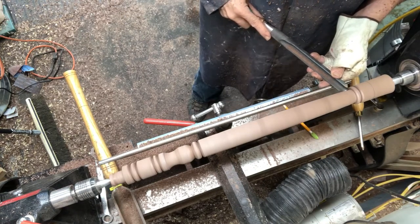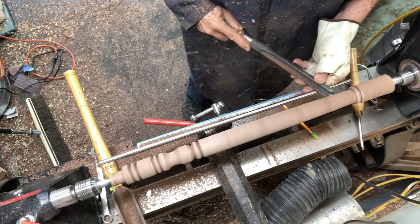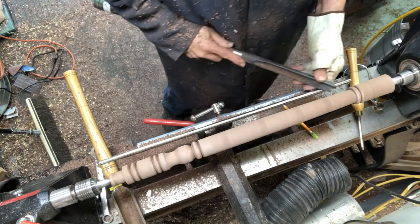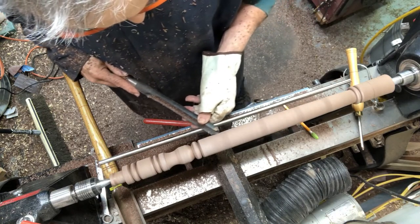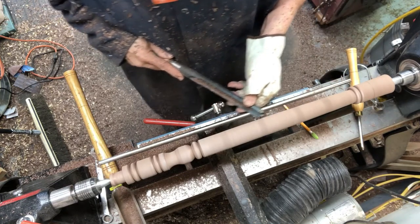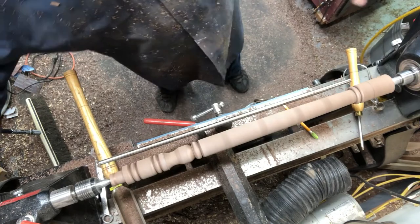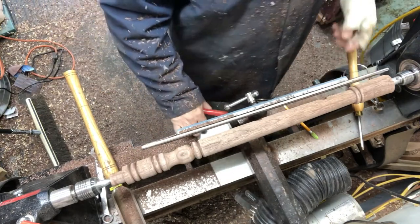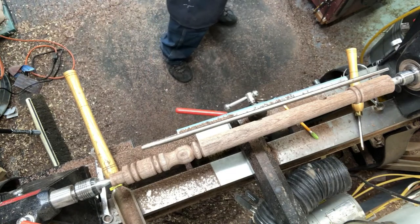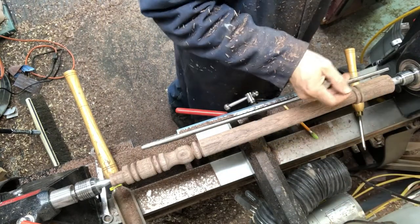I'm starting at the bottom there because I want to make sure I'm not hurting that bead. If I was going downhill from left to right, there's a possibility I would run into that bead. Typically when you're doing any type of cutting you're going downhill, but in this case I went uphill, primarily just to not hurt that bead. If I'm not perfectly straight, I can usually sand that out — I'm usually starting with about 120 grit and working my way up. On this particular project I took all the surfaces up to 240 grit. Here I'm doing another double check on my sample piece that's on my tool wall right in front of me.